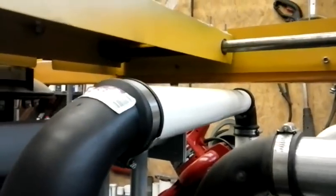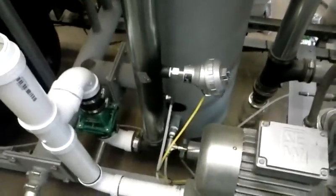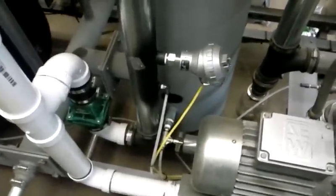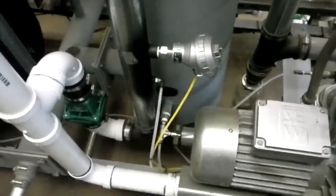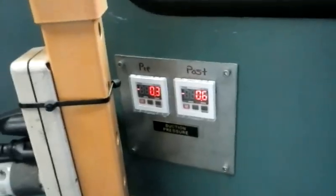It comes across this pipe here and comes down. I will also have a paper filter in this too, which I don't have done at this point. I do have an RTD right here — that's my final gas temperature RTD. I also have a quarter-inch airline going into that, which goes to one of my negative air pressure sensors. I've got two negative air pressure sensors that show my vacuum levels before and after the filters.